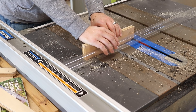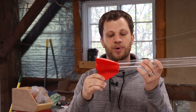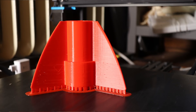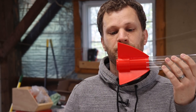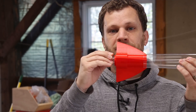I've had this sitting around in my garage for several years just for this occasion. I cut a short length of it and 3D printed a nose cone as well as a base that slides on the bottom. The way this interfaces with the rocket launcher is that it still needs to slide over that half-inch PVC. So I cut off just the threaded portion of the soda bottle, then I modeled the mating threads into the bottom of this rocket base so it will thread right in and slide over that half-inch PVC pipe. I'm going to use super glue to seal and hold it all together and hopefully it will withstand the 40 psi that I'm going to pressurize this tube to.